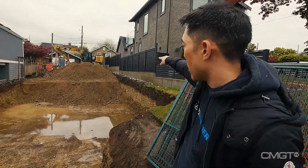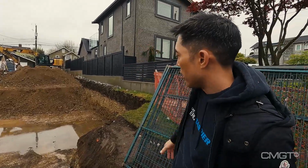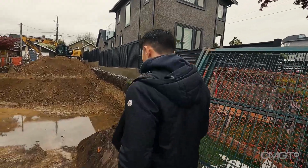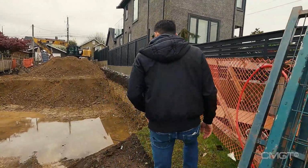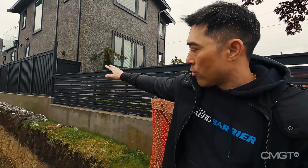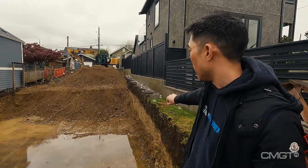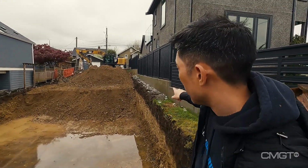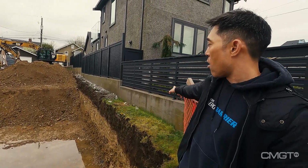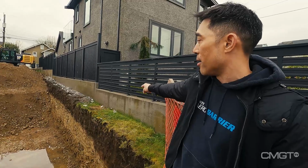The retaining wall running along the side of this property belongs to the adjacent house. So how do we protect the job site when it comes to this kind of open pit with retaining walls? In the regular build, we will drape the poly over the sides of it to prevent any erosion that takes place on the sidewalls. As you can see, this will be a very important step, especially in this case, because there's a concrete retaining wall sitting very close to our cut line.